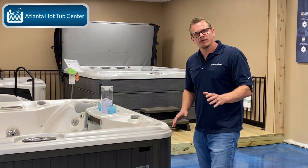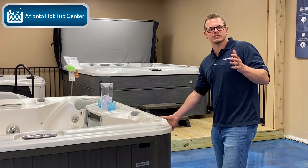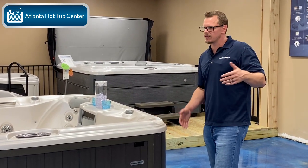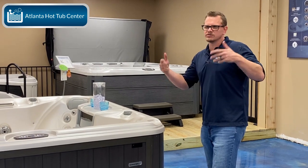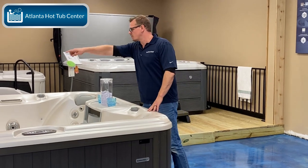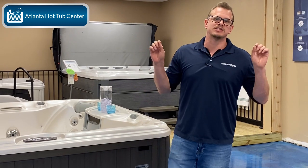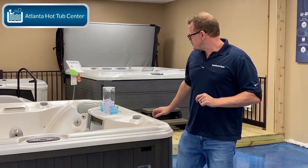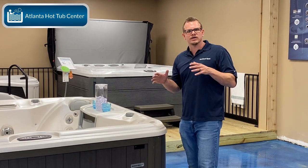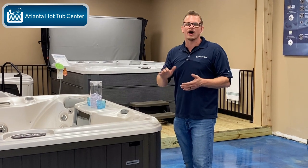If you're putting this on the ground it doesn't really matter. From the outside corner — and this applies to just about all hot tubs out there except your non-self-supporting shell types — you know your Costco, Sam's Club, Home Depot, Lowe's, internet hot tubs — they put motors all over the place. Listen, don't sink one of those, because that is a service nightmare. You're going to have to pull the tub out of the hole every time you need to service it.